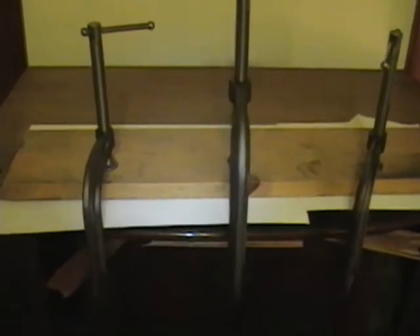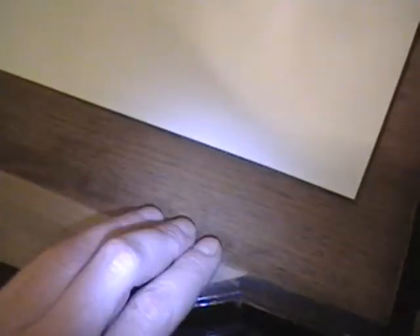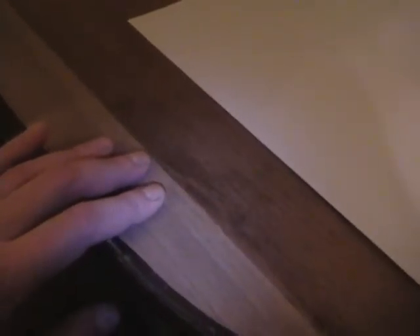Alright, here we are about three hours later and it came out really well. A little bit uneven but I'll simply scrape that down — in fact I already did a little bit. There's some glue residue in there but yeah, there's not much of a height difference at all, so my little paper shim underneath worked out well. It seems to be glued down really nicely with no ripple at all. If you don't clamp it down tight enough when the glue gets the veneer damp, it can start curling up or you could have air pockets — but this seems just fine.